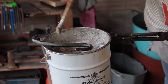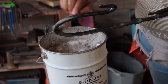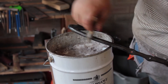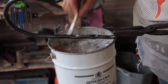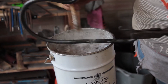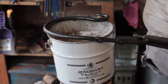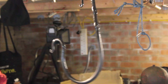I finish it up by warming it over the fire and giving it a generous wax using my Renaissance wax. I use this to seal the metal and fend off any rust. I've got to get the wax in the holes as well because that's the first point where you'll start to get rust. After it's been waxed, I hang it up and leave it to air dry and cool.